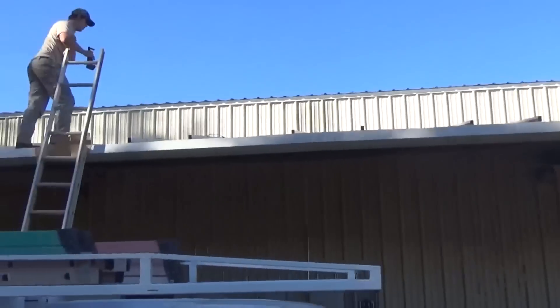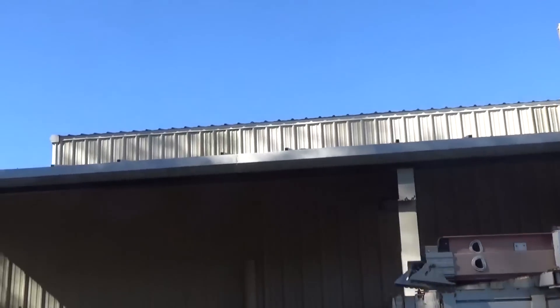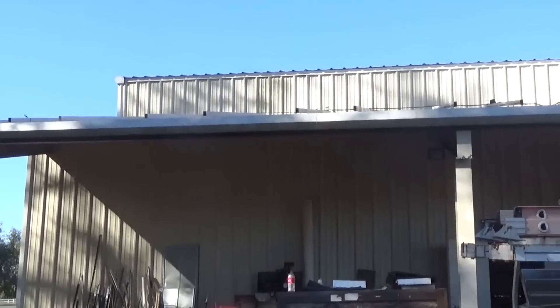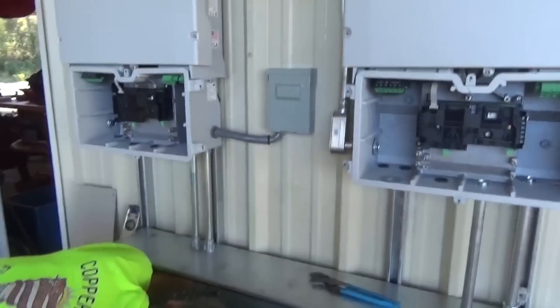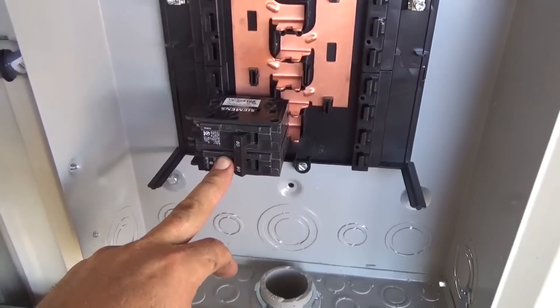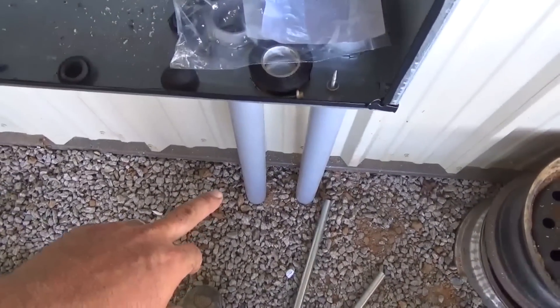We're using the Snap and Rack system again — top notch. Towards the end of day three, we had so much plumbing and trenching work to do. Now we're getting some panels going and tomorrow we'll knock out the whole array. We're finishing up the inverters, all the EMT, and the Myers hubs to make sure we're waterproof going into the gutters — even though they'll be protected under this roof, you still have to code with Myers hubs. The sub panel will be fed by each inverter going to a 40-amp breaker, and three runs of #1 copper are going to the house — it's 590 feet to the house.